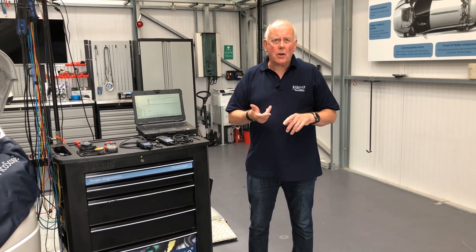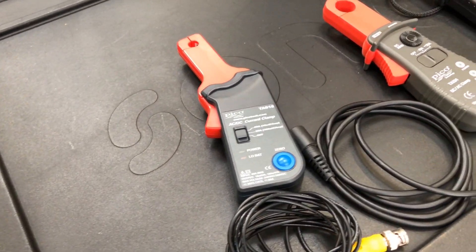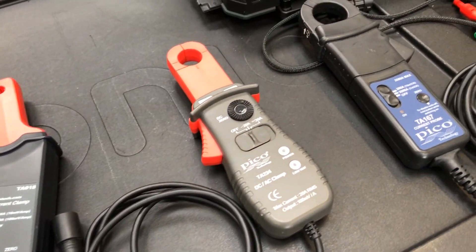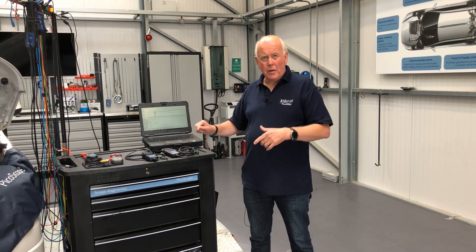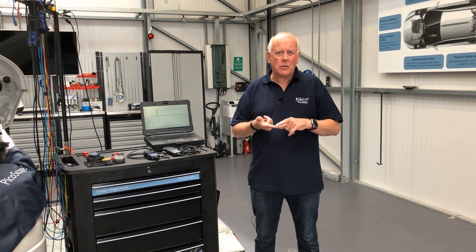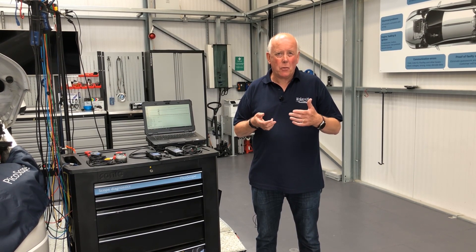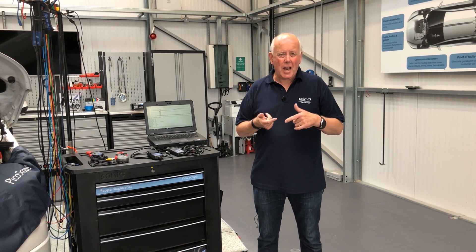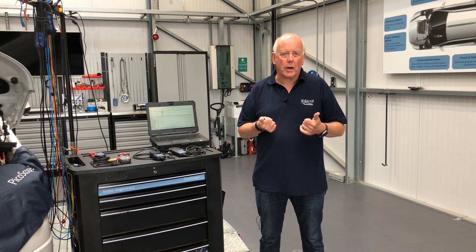Here are five golden rules with current clamps: check the battery has got power; turn it on and remember to turn it off; place the current clamp around the wire and close the jaws; always acclimatize the current clamp to the environment you're working in 15 minutes before using; and if you have interference on the reading, you can use filtering which is in the software.